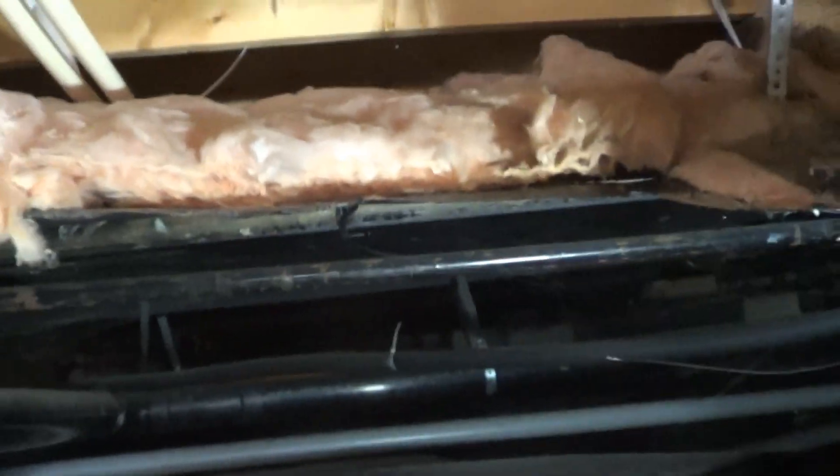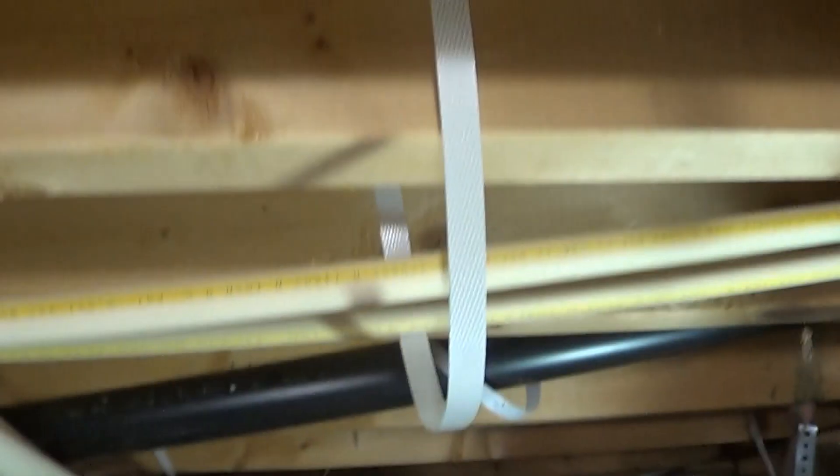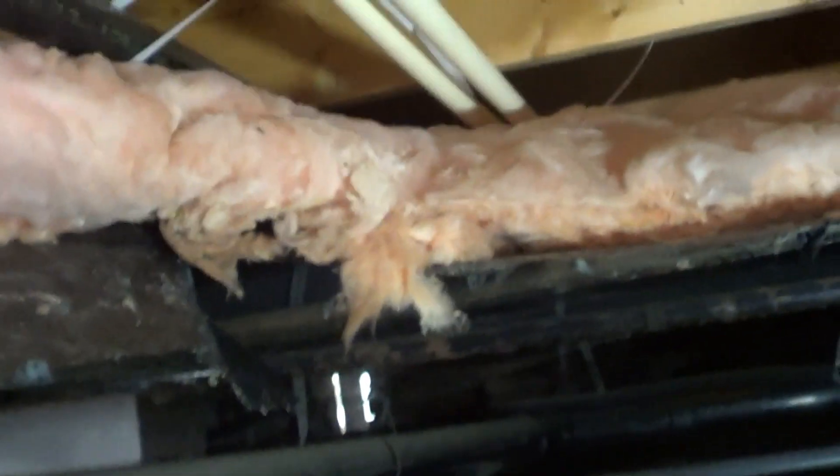Sometimes what we like to do — you can see the I-beam there, and between those I-beams they have these little cross bars right here, sometimes every six feet, sometimes every eight feet. What we'll do is put a piece of plywood right on top of those, and then insulation on top of that, which holds it and lets that environment stay intact. So that's what mobile home drains look like.